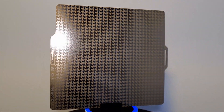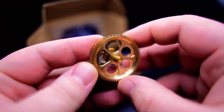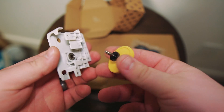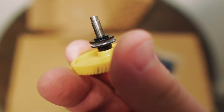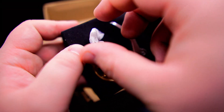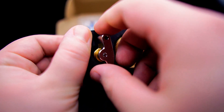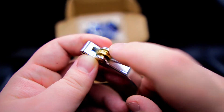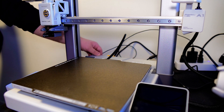We're going to begin with the hardened extruder gear, which will be replacing the plastic one that originally comes with your printer. The reason you'd want to change over to a hardened version is that the steel gear will outlast the plastic one. I'd highly suggest only doing this when your extruder is experiencing problems such as under extrusion or over extrusion of the filament.